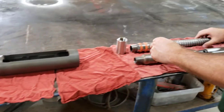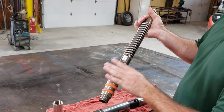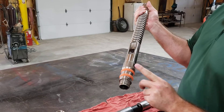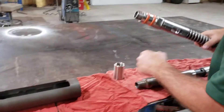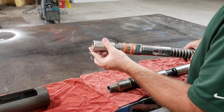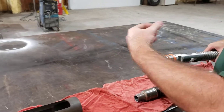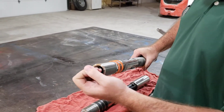Now with the bumper spring, you can use either the bumper spring or if you just had a hanging mandrel without the spring, you need a fish neck, a flow-through, and pack-offs so that way the fluid can go through. We would put our sub onto the bottom of this, and you'll see that we have the 1 inch NPT where we would put our tools into.